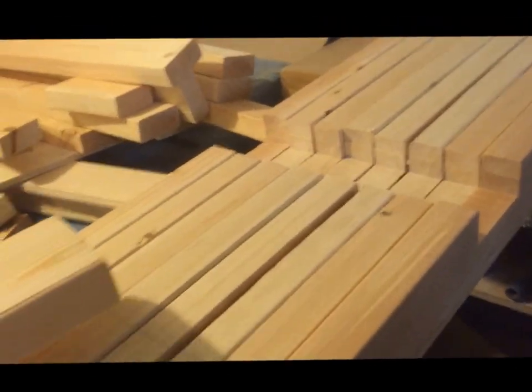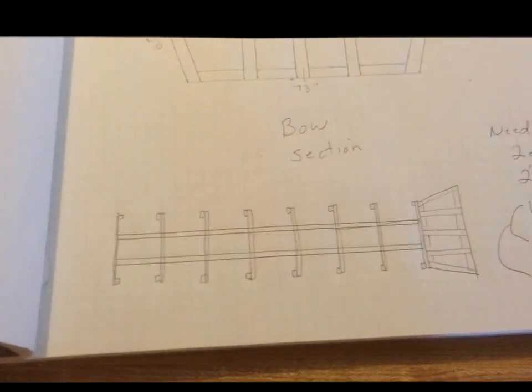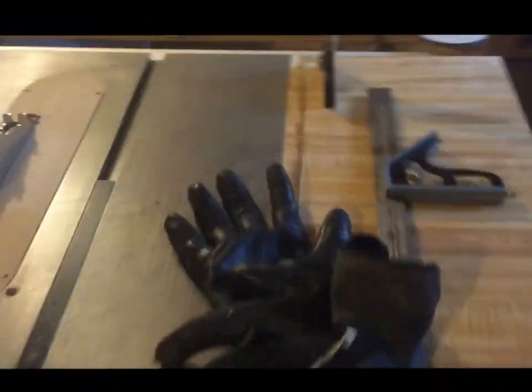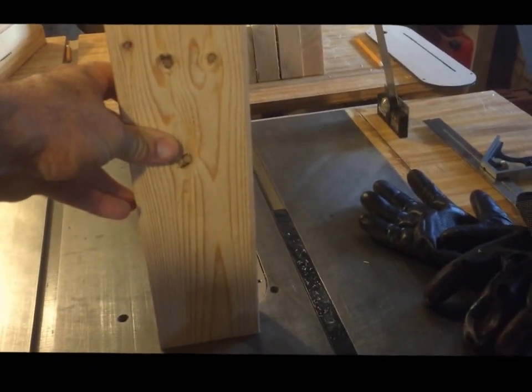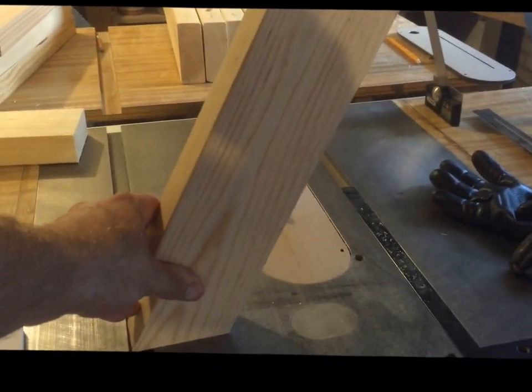We got the final notch depth cut and the 2x4 is fitting, so we're good there. I have the eight frame members I had planned in my drawing, plus the bow piece. Looking at my drawing and thinking about it, the way I have the transom designed it was going to be straight up and down. This is a duck hunting boat, so if you think about getting over a bog and trying to push this backwards into a bog, a straight transom would not work so well. So I think I'm going to cant the entire transom backwards.